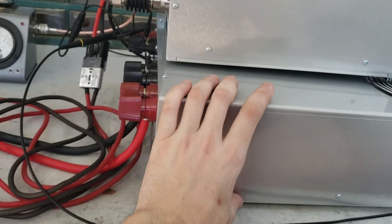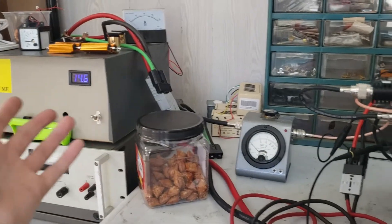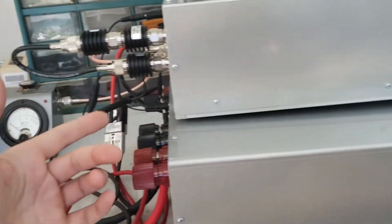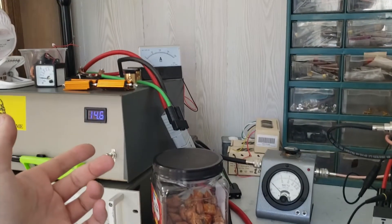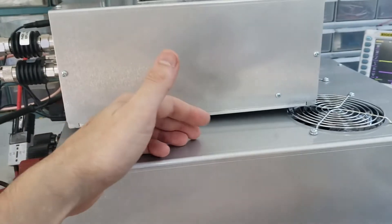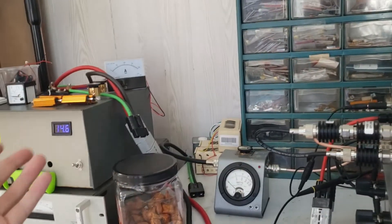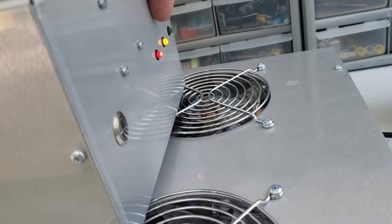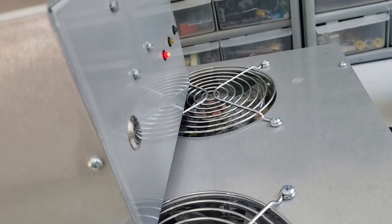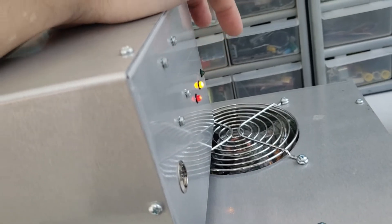Right now I've got the power supply running in what you might call an on-demand mode. There's 14.4 volts going into it, but the power supplies are basically off — there's nothing coming out except that 14.4 volts. The way these modules work is when they're turned off, they basically have a path straight through from the incoming power supply. So right now the amplifier is getting that 14.4 volts, and you can see that because the LEDs are turned on. This red LED means there's power coming into the unit, but it's only 14.4 volts.